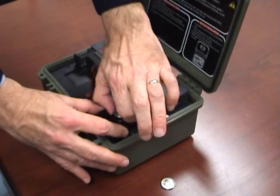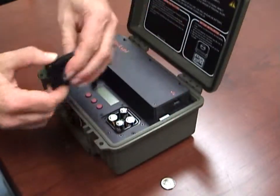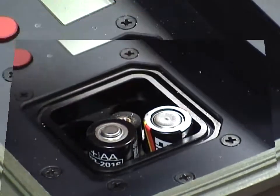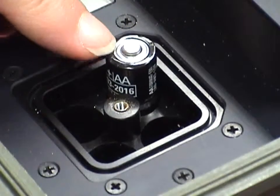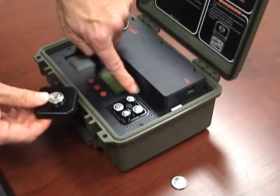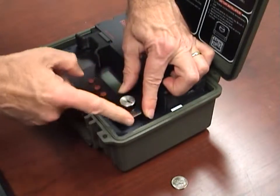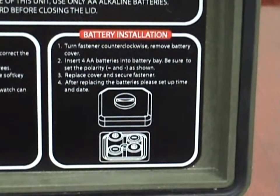To replace the RadLite batteries, remove the battery lid by unscrewing the large fastening screw. Remove the old batteries and replace with fresh ones, ensuring that you have the correct orientation when replacing the new batteries. Replace the battery housing lid by aligning the cut edges of the lid and housing, then tighten the fastening screw. Instructions are included on the bottom of the RadLite reader cover.